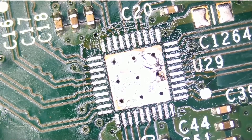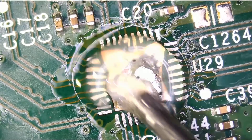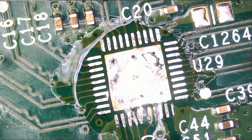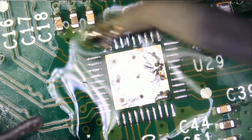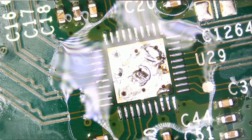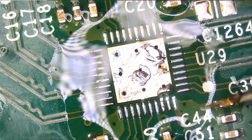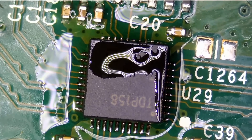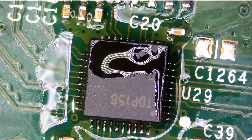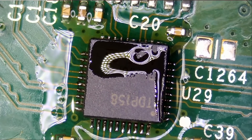Let's apply a fresh layer of leaded solder. Now we're going to grab the new retimer chip — the chip will be sold on our website in case somebody needs it. Let's place it — pin number one should be on the bottom right like this. Air speed at maybe 70 or even 50, and temperature at about 380.